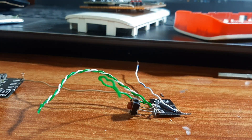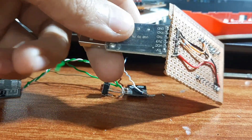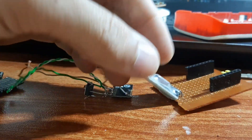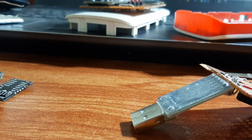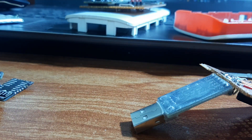I made this programmer for a USB cam board a while ago — you can watch that video on my channel. I'm going to use this USB to TTL converter for uploading a program to this small board. Transmit goes to receive and receive goes to transmit, so the transmit pin on the board connects to the receive pin of the programmer. This allows the board to communicate with your laptop or PC. Positive connects to 3.3 volts and ground connects to ground.